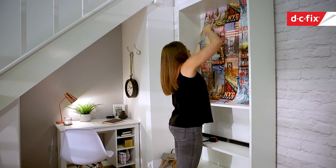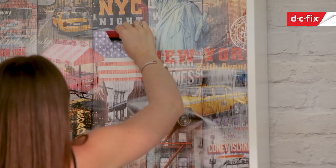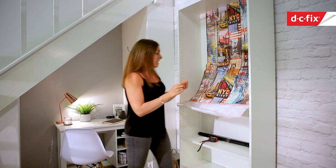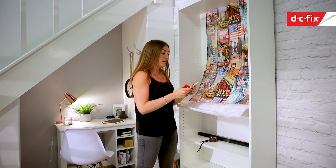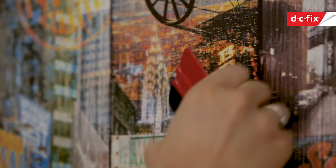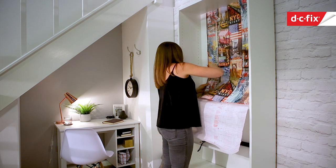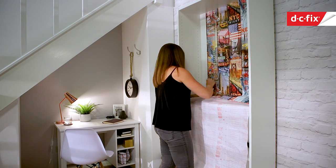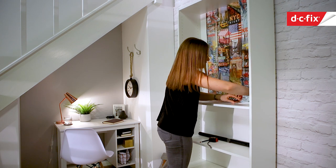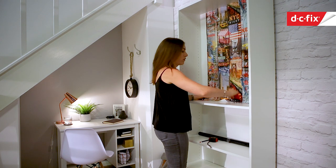Start pushing those air bubbles out. Here I've got a bubble — it's not completely flat. The only way to get rid of it without peeling it right back is to just prick it with the tip of the scalpel or a safety pin — that just lets the air escape and you can push it out using the smoother again. I'm going right down to the bottom, then I'll trim off the excess once I'm into the join where it meets the shelf — just going down and then along the shelf, pushing that air out.